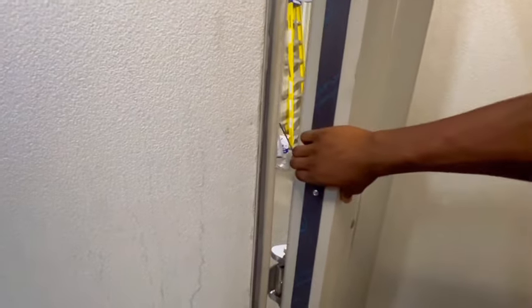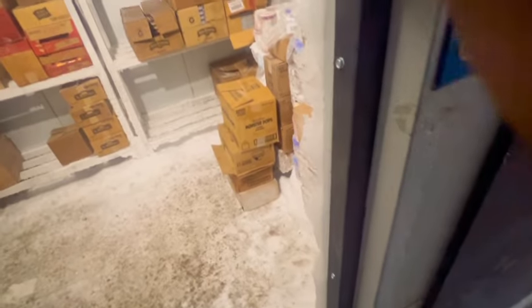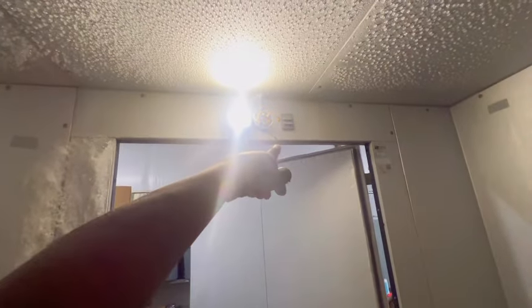It is running — as a matter of fact, on this side I feel pretty warm. What I'll do is take that apart, check the amp draw, and go from there. I verified the amp draw and we got 1.2 amps, so the heater is working properly.